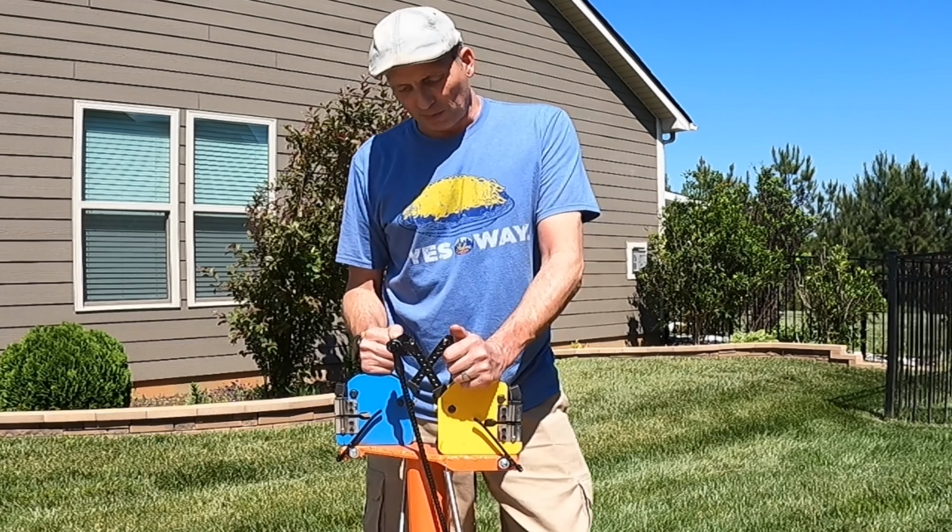However, these also have a bolt here in the bottom of the handle that you can adjust in and out and set the depth of how far the throw is on the lever. So if you're only wanting to shrink partially, you can set that depth and do less stretching or shrinking and make that repeatable every time on your piece, so you can get much more precise.